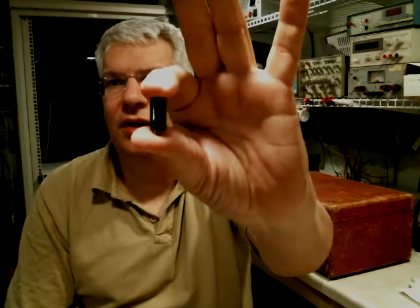In a lot of electronics that were manufactured probably between 15 and 12 years ago, there's a manufacturer that made a bunch of faulty capacitors, and there are billions of these capacitors out there. This has been a known problem for quite some time. I'll show you what I found. I basically replaced this little guy right here, and the printer started working again. So let me show you what a bad cap looks like.